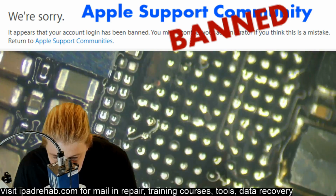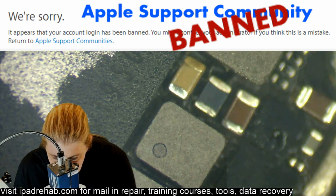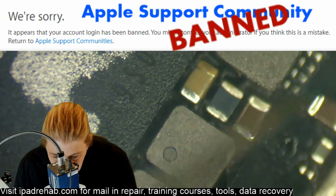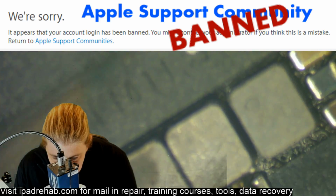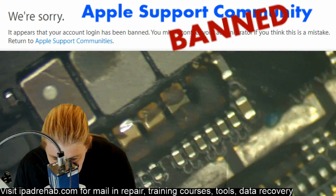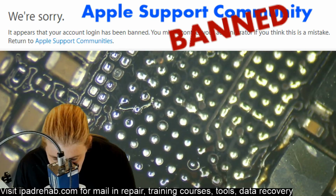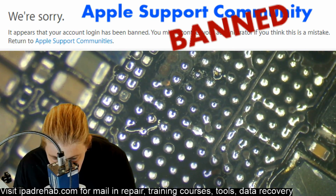So this phone came in, I had to do some repair. It even had solder balls. You can still see a solder ball peeking out by this coil. It had another one here by the CPU that worried me, but right now it boots, and it makes an image. So we are gonna just go ahead and see if we can fix up this touch.